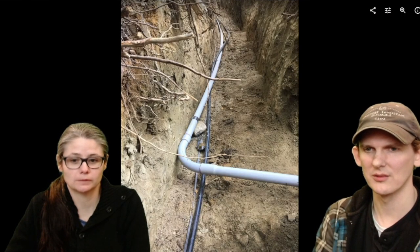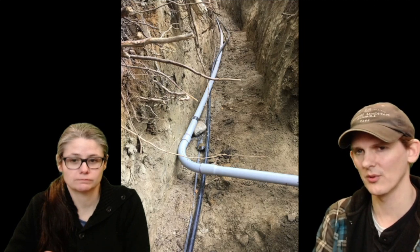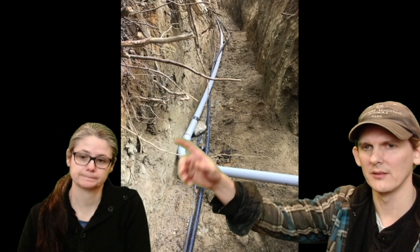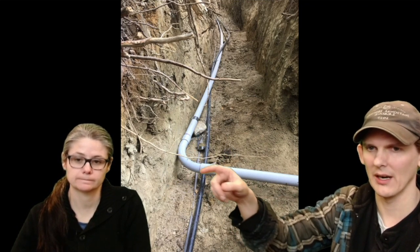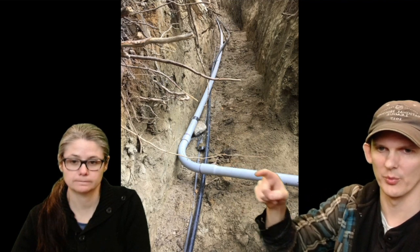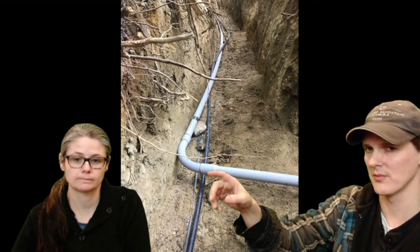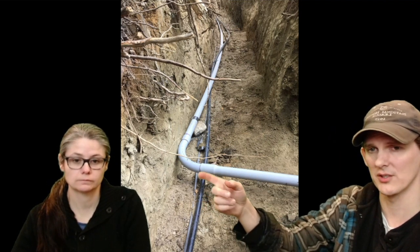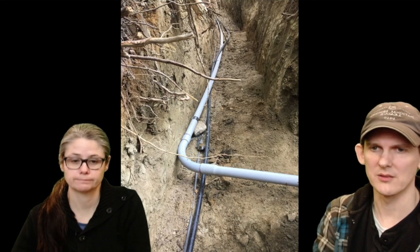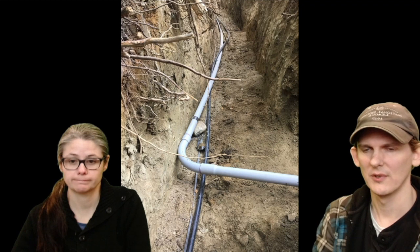So this bend is just a bend to the top, going around these corners. You can get some wide turns. This is a really narrow turn here, but if you have a bigger size pipe, you'll have a super wide turn. And sometimes, depending on your local regulations, they have to be metal bends. But that's not required here because this is secondary service.